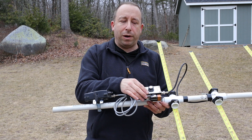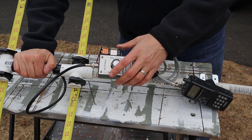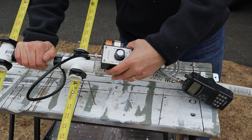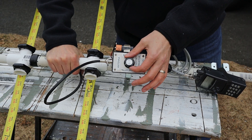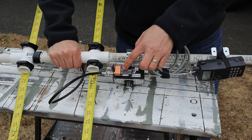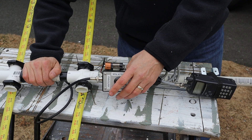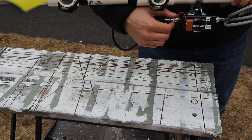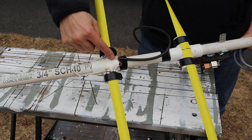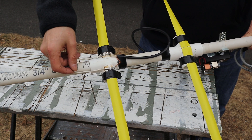The big difference with this antenna is that Bill has mounted an offset attenuator on here as well as a clamp to hold the radio. The attenuator is mounted to one of these squeeze clamps so we can easily remove or reposition it. On top of the attenuator there's a knob to control the amount of attenuation, and on the side he's got an on/off switch and a battery to power it. There's a short piece of coax between the attenuator at the BNC connector over to the driven element, with the coax stripped and soldered to each side, and a little tuning hairpin as well.